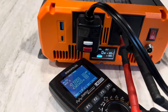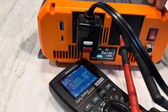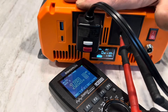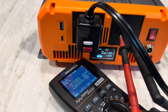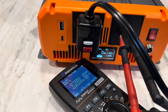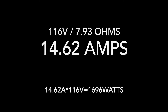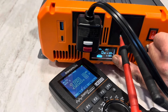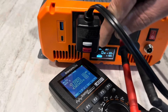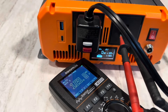I'm just going to do a little test hit. The voltage is probably going to drop a little bit because the battery I'm using is a little slack on charge and I've only got number four cables coming to this big monster inverter. Remember, Ohm's Law applies — I've turned the voltage up, the resistance is the same, but I'm pushing against it harder, so it's going to command more wattage or more draw from the inverter. Just watch the DC voltage right here. It's probably going to flatline due to that cabling, but I'm just going to show you that this voltage is not going to drop down into the 105s or 108s or anything like that. So just a quick hit.